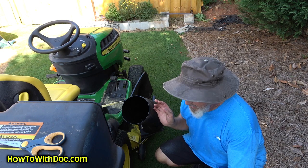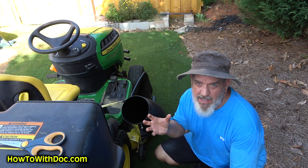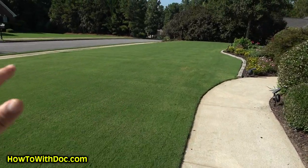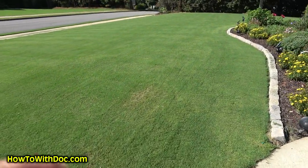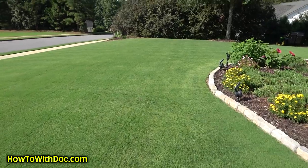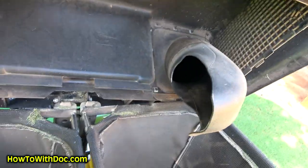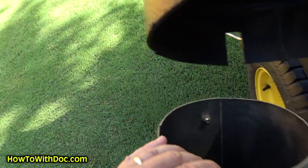Basically what will happen now is all that grass will just flow through — it's the liquid that sort of adheres to the side. There's your little tip for that. I just picked up a ton of clippings off this and they were all soaking wet. We picked up all the clippings — didn't have any clogs. They were wet enough to cause issues, so let's check what it looks like. Looks pretty good. The tube looks nice and clean too. Not a single blade of grass stuck inside there. Even when these clippings are damp and wet — it works.